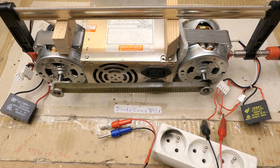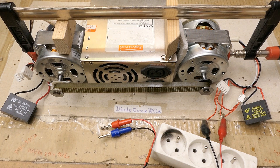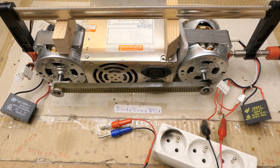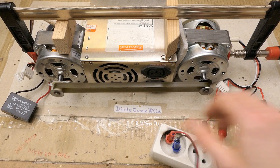So an asynchronous motor definitely can supply power into mains when it's operated above its synchronous RPM — the slip is basically reverted. But could it generate as an offline generator? I've heard that it's possible with some parallel resonant capacitor, but I never tried it before. Of course everybody wants to see it turning. It works!